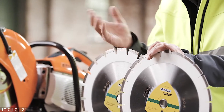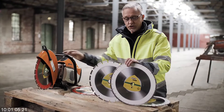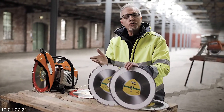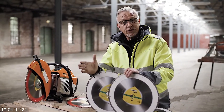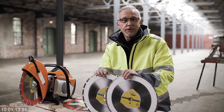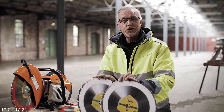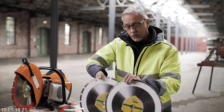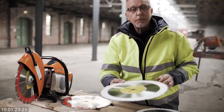With an open segment, if you're cutting concrete on a handheld machine like this, the quality of the cut is probably not so important. A more open segment allows you to work faster and more efficiently. So just on the segment alone, this can change the characteristics of the blade — one gives speed, and one gives lifetime and quality of cut.